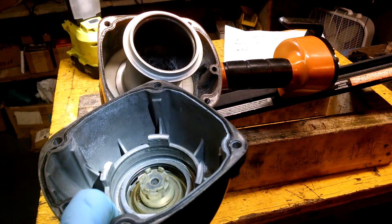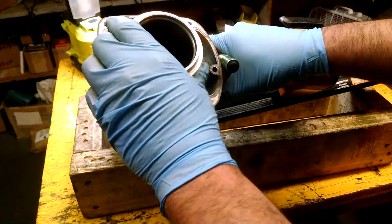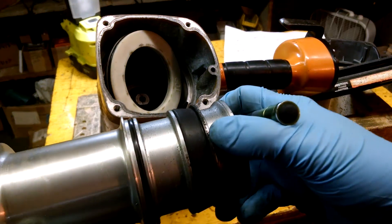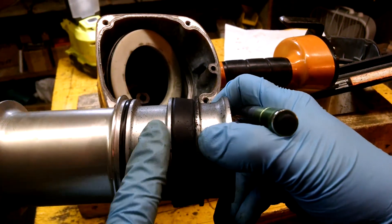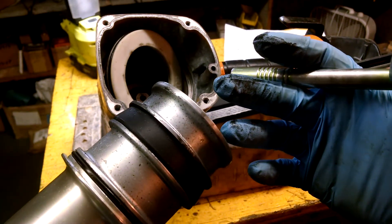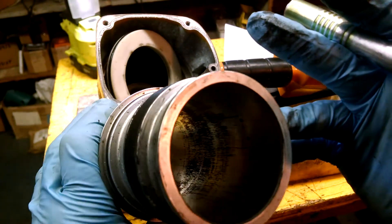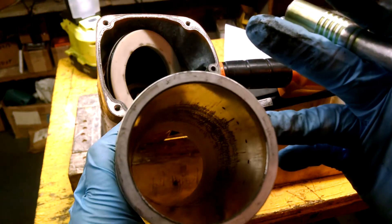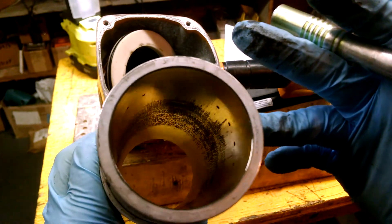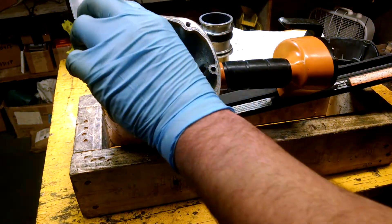Can you even see the O-ring in there? That's just amazing. So I'm going to pull the cylinder out here. Not a trace of oil on here anywhere. I feel a little bit of the residual grease from the factory, but that's about it. Just amazing. And you can see that rubber deposited on the inside of the cylinder there — you shouldn't see it like that. You might see a little bit of streaking here and there, but that's about it.